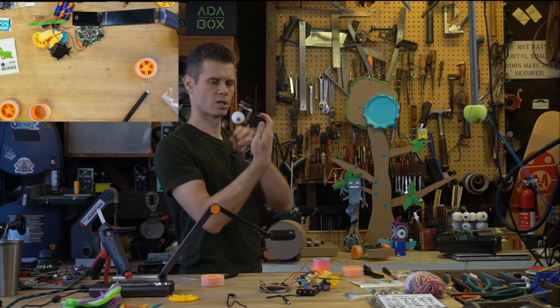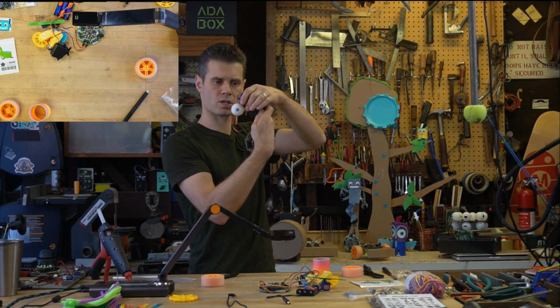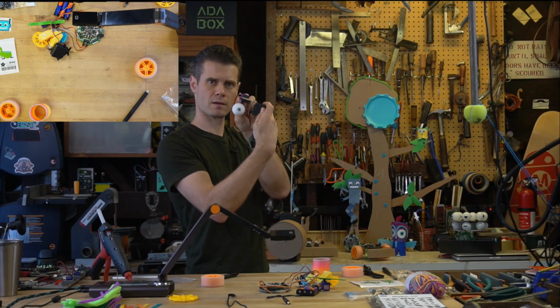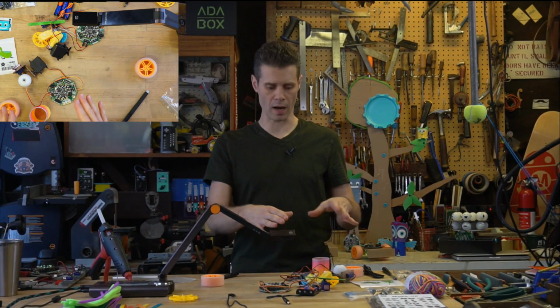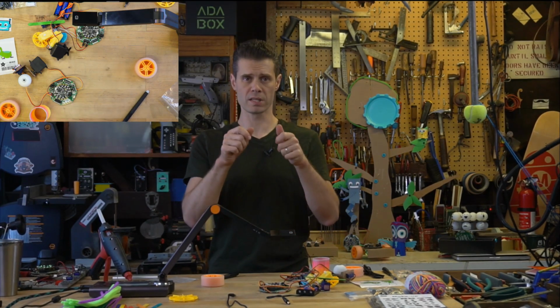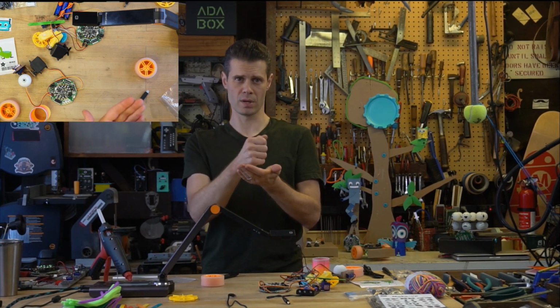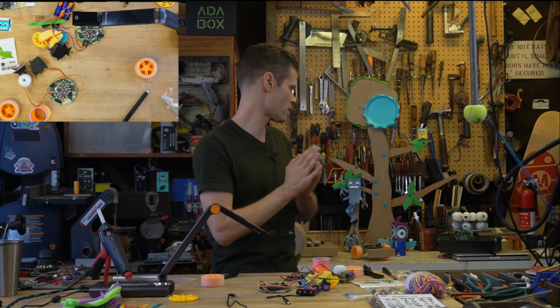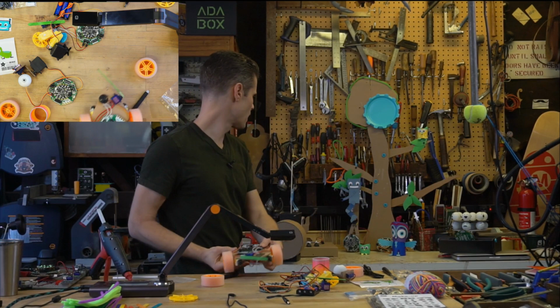It uses 2 servos, one to move in the x-axis and one in the y-axis to look around. And you can extend that one. Like I mentioned, we've got these inputs for potentiometers, which is essentially what joysticks are. If you get a joystick that has an analog potentiometer style, you could do some really cool fluid movements with the eyeball. There's my friend the bumper bot that I mentioned.